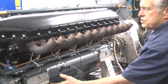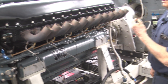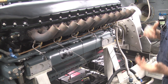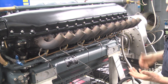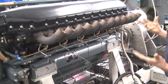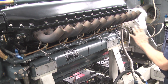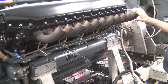These are the digital exhaust gas temperature probes. We are able to monitor each cylinder via our computers in our trailer. Everything on the engine is downloaded both analog on the instrument panel and digitally on the computers. We're able to actually log what's going on and give it to the customer in real time, or just do a video of the engine for them. Just for the record, it's a 12-cylinder engine — not 24. Each cylinder has two exhaust ports, that's why you see all these stacks.